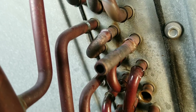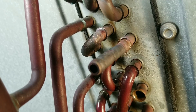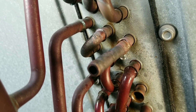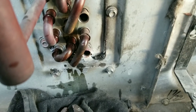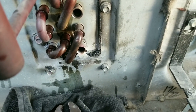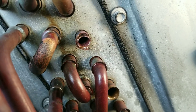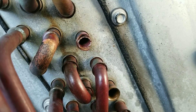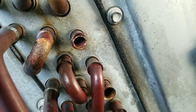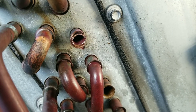As I was unbrazing that stubby right there, it started pouring oil out of it, so I had to stop brazing. I'm guessing that's the main orifice that was plugged up. I expected that bottom one to be the toughest one, but it was the very last one on top. The copper stub sort of just broke off as I was trying to unbraze it and pull it out. Now I have to figure out a way to get that little piece of copper out of there so I can braze in the new header.